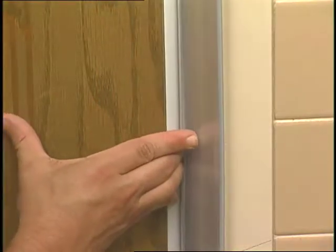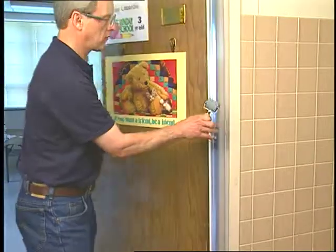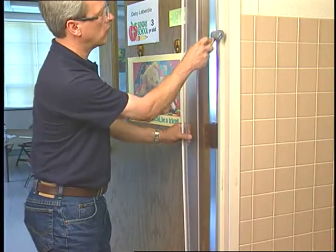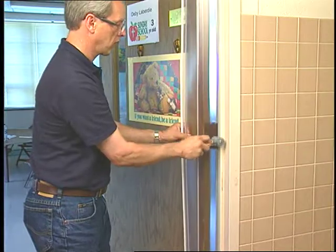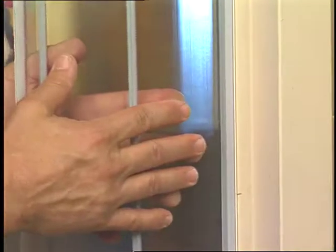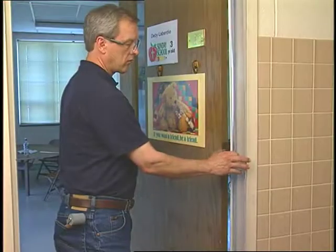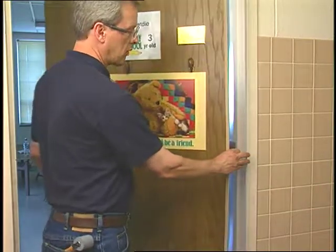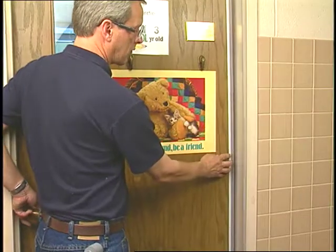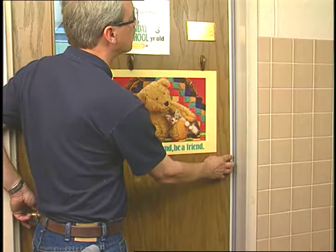Carefully slide the guard over to the side jamb and tack it in place. Open the door and open up the guard. Now, roll the area with a wallpaper-type seam roller, pressure stick, or a clean soft cloth. If you think it did not install properly, peel off the guard and begin again, as this special tape is repositionable. Now, close the door to secure the angled side of the door face. If there is a push bar, you may need to perform this with the door partially open, and then close the door during final application.